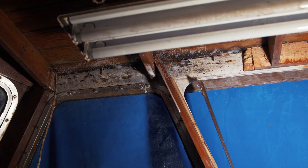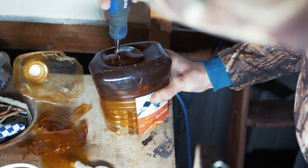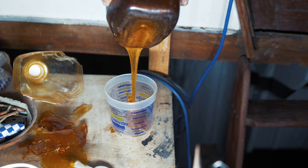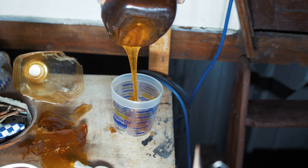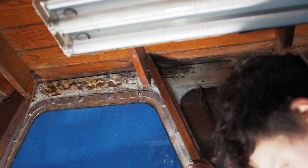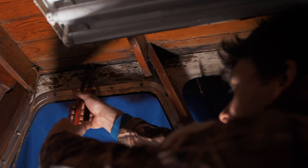The plywood seems in good shape as well, though there are a few minor specks of mould, so I just bleached that, dried it with a heat gun, and then applied a polyurethane wood hardener. I transferred it from the old tin as the lid broke and it was constantly drying out — I moved it to a white spirits bottle but it still somehow set off within the container, so I burst it open and used what was remaining.